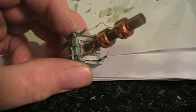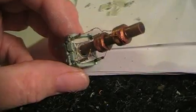Here's a good view of the top of the base. I've got the plastic cover removed and you can see the little arms from the lugs that go across that silver piece of foil in there. What I'm going to do is go ahead and try to bend those up a little bit and remove that foil to take a closer look at it. Now you can see that I've got the foil capacitor removed, although it did come out in two pieces. I've got it sitting on the white piece of paper and we're going to take a close-up of it to see what kind of damage we've got.